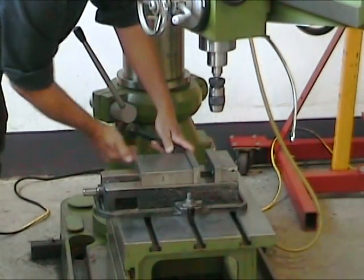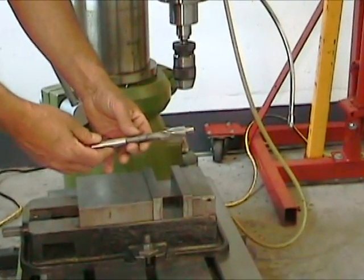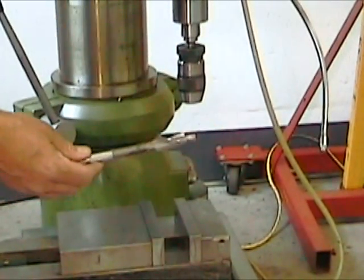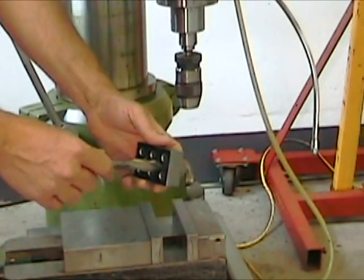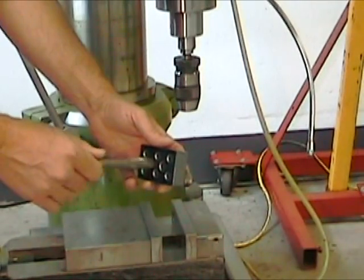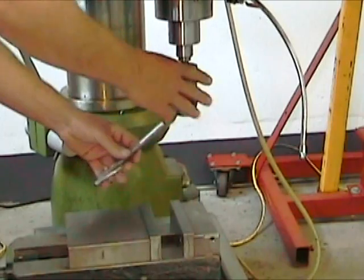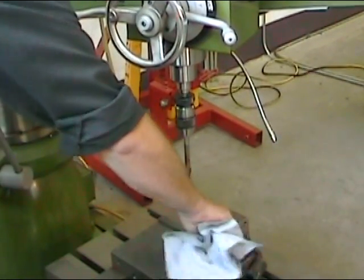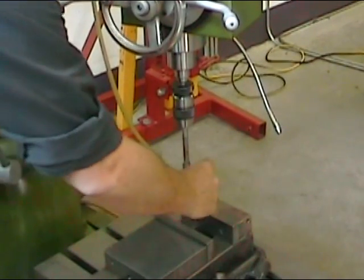The floating head can be positioned anywhere above the table. In this case, we're going to be using the positioning tenon on the end of a counterboring tool to position the tool directly above the 11 millimeter holes that we produced earlier. Obviously, since the tool's tenon guides itself in the hole and the tool is going to be in rotation, make sure that it fits freely in the hole before you start this operation. We don't want any leftover chips from a previous operation to skew our positioning, so make certain everything's clean.